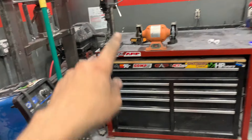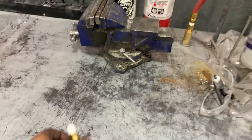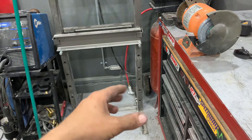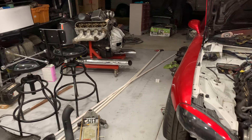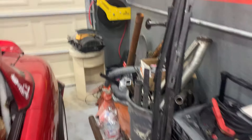Now it's time to run the PVC all the way around the water heater and over to the bench. I'm missing a 90-degree fitting, so we won't be able to get all the way around the water heater today, but we can build the rest of it. I also need to get a couple more quick-connect fittings. I need to put a drain in the system somewhere because, as you know, when you run a compressor moisture develops and comes out of your air tool or when you're painting — you'll see water droplets come out. That actually happened when I painted the top on my truck.